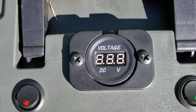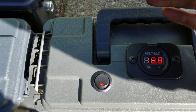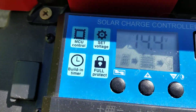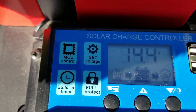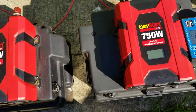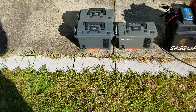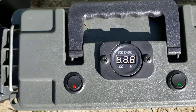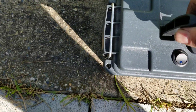Hard to tell out here because it's so nice out, but you can see they're getting a charge — along with these bad boys here. These solar charge controllers don't go up that high; the highest they go is 14.4 volts. On my she-shed setup they go up to 15 volts, and I'm thinking the little ones I've gotten here also only go up to 14.